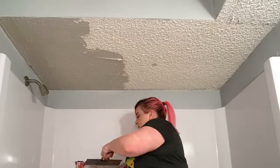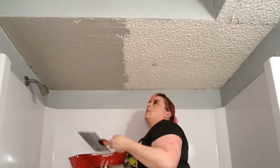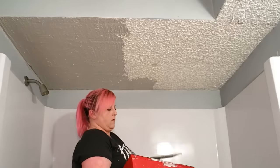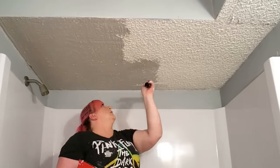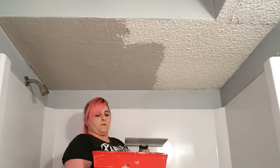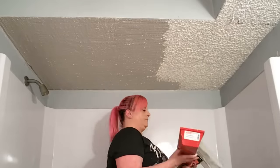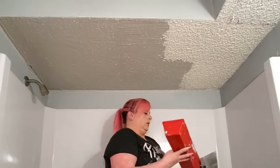And if you don't have a bulkhead in the space that you're working in, this might not pertain to you, but my bathroom does have a bulkhead and they texturized that as well as the actual ceiling. So the process is the same for covering both of these. The only difference is there's an edge of this part of the ceiling that has an outer corner. So when I got to that outer corner of the bulkhead, I just applied the skim coat as close and as neatly to the edge as possible.